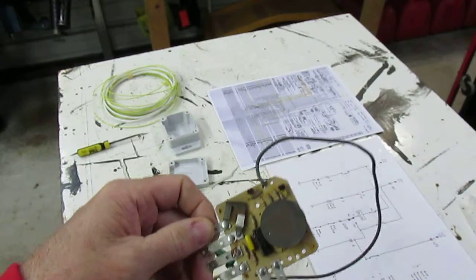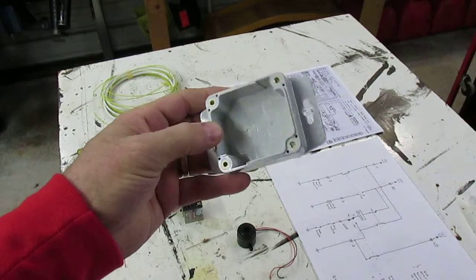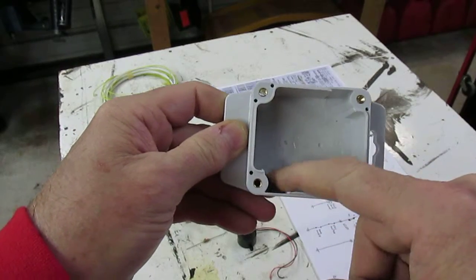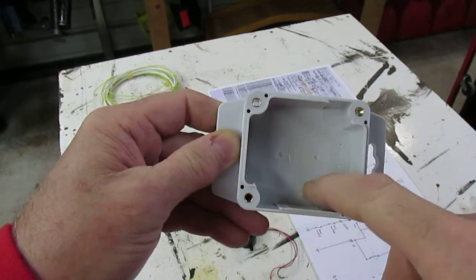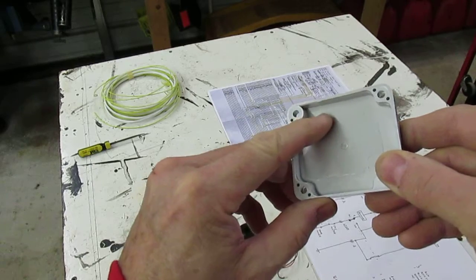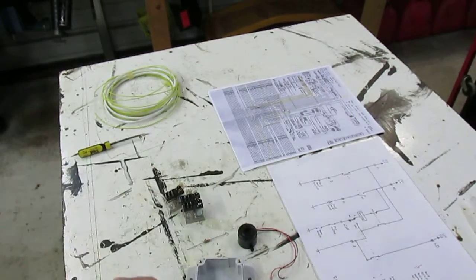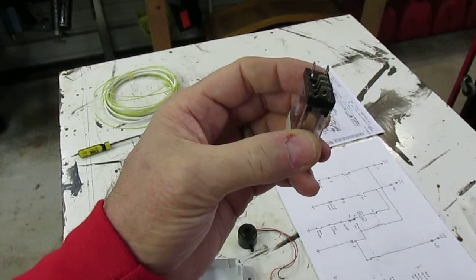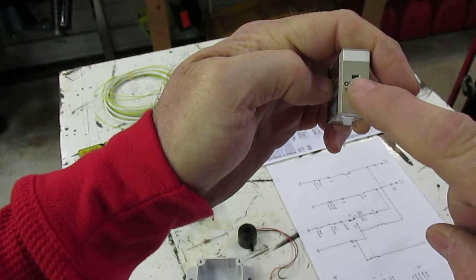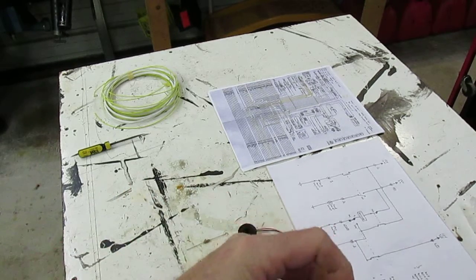I was talking about making one of my own using relay logic and I'm going to show you how I'm going to do that. I've already got the parts. I'm going to use this plastic electronics enclosure that I bought. I had to do a little bit of modification to it - it's a really heavy, thick box. It had some corners molded into it that I milled out to make more room for the relays, and I did the same thing for the cover. I'm using three relays: 12-volt coils, single pole double throw relays. They even have a little indicator light - when the coil is energized that light will be on, which is nice as a diagnostic tool.